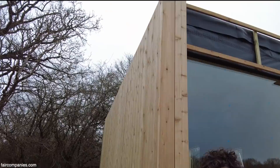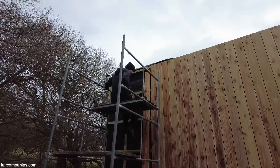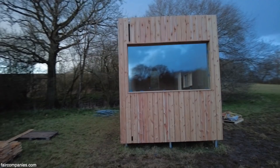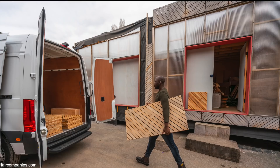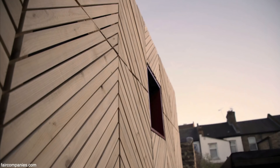The reason why we like Western Red Cedar is it's one of the most durable softwood materials that we can grow in the UK. Even untreated, it will last anything from 15 to 30 years. Here we have something that's starting to look quite a bit like a cabin. There are various approaches for cladding — we've made these modular panels where rather than putting cladding straight on the building, you make the cladding into squares and then screw those on, so you can have an assembly line making the panels in a modular way as well.